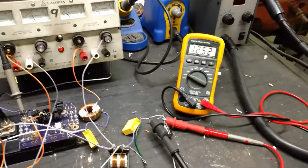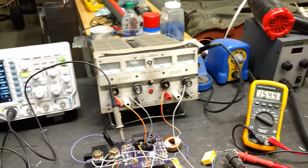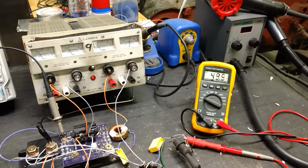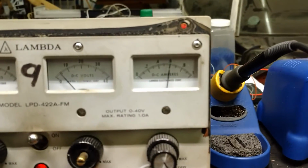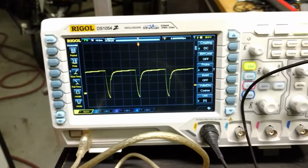I really wished I could see the volt rating on that cap. Oh no, it's a 160 volt cap. We can crank it up. Let's see how far it goes at full duty cycle. Oh wow. So 53 volts. Like, we're producing amazing voltage. It's pulling a bit of current now, but look at the voltage it's producing, and the duty cycle's up there.